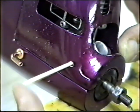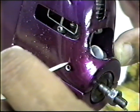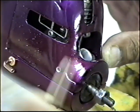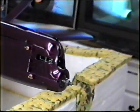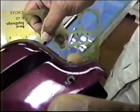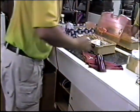You can see you want to exaggerate the hole to the high side. The circle should be right coming down here. Okay, now you can get a circle template and trace out the circle template on that angle. Now we know which dimension we need to get a little bit more clearance on. Take the same tool and very gradually take it out. Go right up to the line.